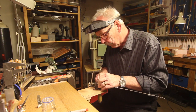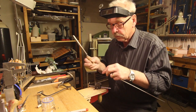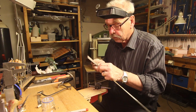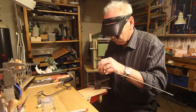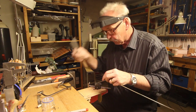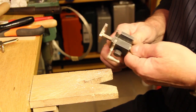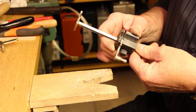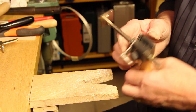I'm using three millimeter square wire for this project, and here I'm cleaning the end and filing so I'm sure that I have a 90 degree angle. This is a tubing cutter jig, which is very useful to cut tubing and wire to a certain length, and here I'm going to adjust for 85 millimeters.